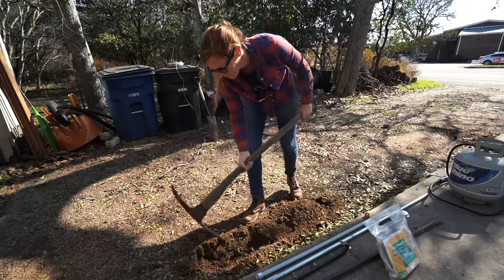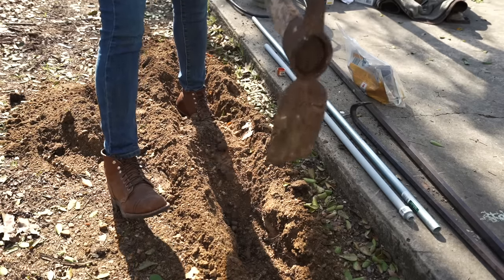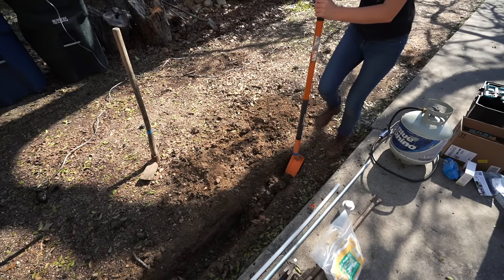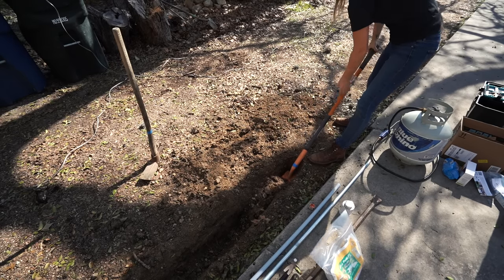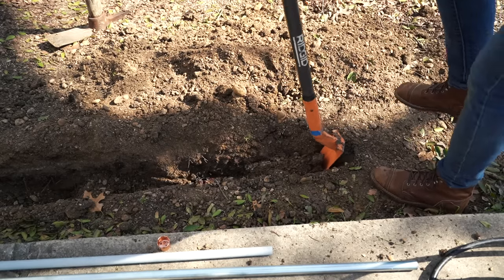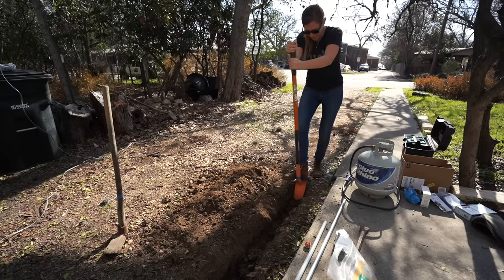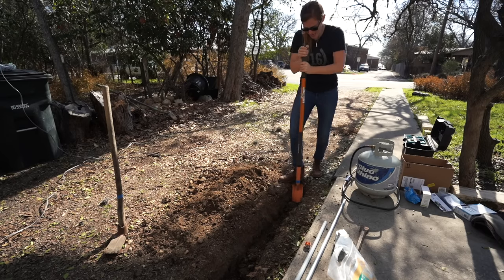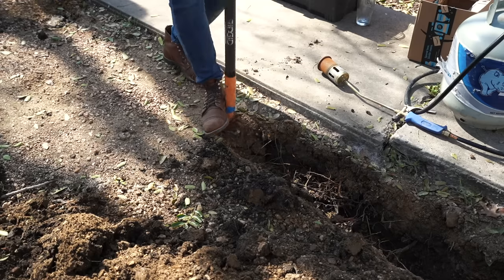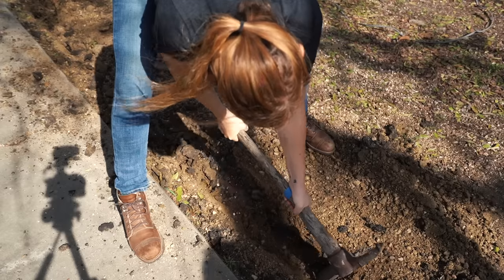Once I was done I started trenching. If you have a big job then consider renting a piece of equipment for the day. This wasn't that big of a job so I grabbed a combination of tools and got after it. What I found particularly useful was this smallest shovel — I'm not sure what it's called or its intended purpose, but its narrow profile was perfect since I don't need a very wide trench. I plan on doing a direct bury, meaning I'm placing bare cable in the trench instead of running it through conduit. According to code, if the circuit is protected by a GFCI then a trench can be 12 inches deep. Be sure to check your codes before tackling this job.